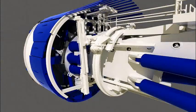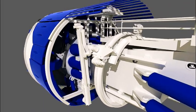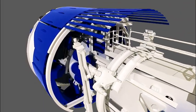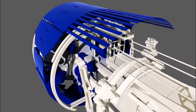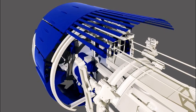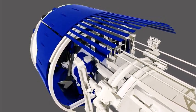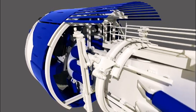The Robbins TBM offers unique cutter head efficiency. Hard rock cutter heads can vibrate intensely during operation. The Robbins TBM provides hydraulic bracing which expands radially to significantly reduce vibration and disc cutter wear. In addition, Robbins hard rock cutter heads are significantly deeper than the industry standard, further enhancing the rigidity of the structure and rock cutting efficiency.